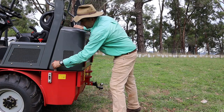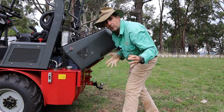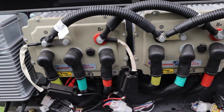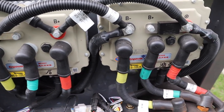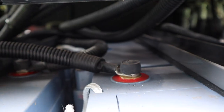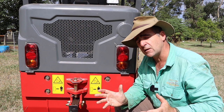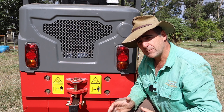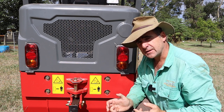Now let's crack open the boot and have a look at what you get. Behind the driver's seat is a DC converter and three power controllers. Below that to the right is another electric motor that drives the hydraulics for the mast function and the hydraulic pump. It still runs on deep cycle lead-acid batteries, and this is a good thing if you don't like the sourcing concerns around lithium and you need a little bit more weight in the back for ballast — so they're actually an ideal choice for a machine like this.